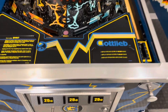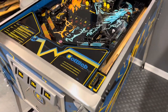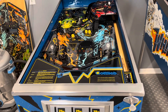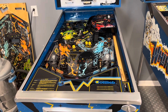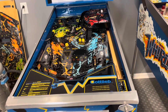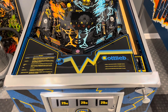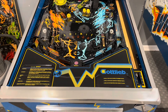There's our lock bar in place — that looks really nice, turned out great. I didn't even bother doing the other one after I got this one done. It's going to have the divots, but when you see lock bars that don't have the divots, that usually means they're glued on the back and they pop off all the time. I was buying all these chrome and brass plated ones and half the time before I could even get it out the door, the back was coming off. They were doing that so they wouldn't have those obvious divots from where they spot weld the bracket on the back of the lock bar. But they got away from it — you just have to live with the divots because you can't have all these lock bars falling apart. So it's welded for a reason; you're asking a lot of that thing.